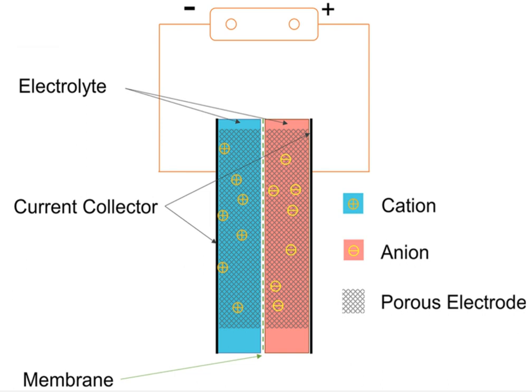This formula describes the amount of energy stored and is often used to describe new research successes. However, only part of the stored energy is available to applications, because the voltage drop and the time constant over the internal resistance mean that some of the stored charge is inaccessible.